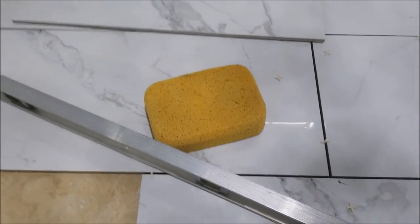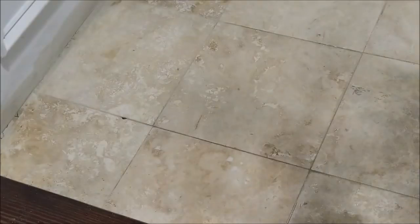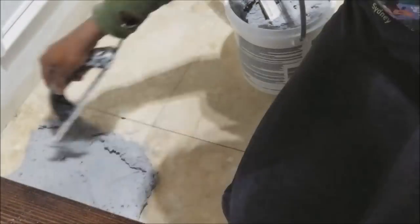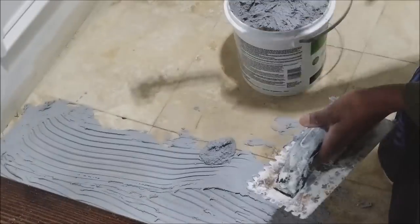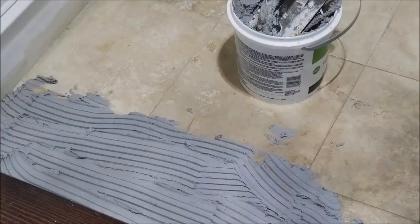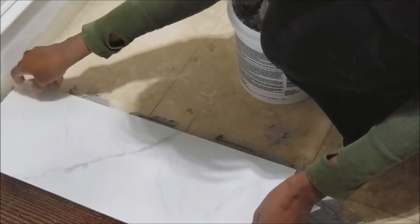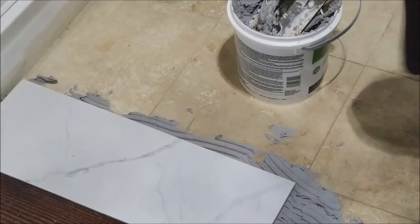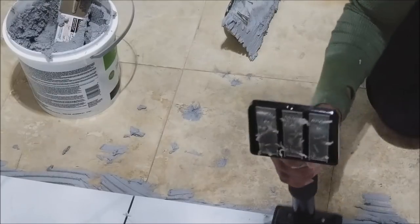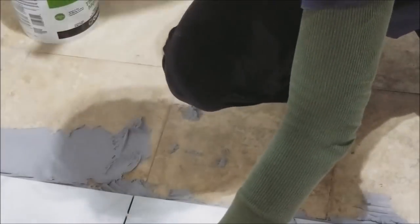Once you have done everything you have to do some cleaning up, so you will need this sponge. What I generally do is cut my tiles ahead of time and lay them out to see how they are going to look. Then I go straight to the cement, laying the cement down, and then I can just do all the laying of tiles without cutting in between. Using your trowel to smooth it over and then putting your tile on top. I didn't raise the tile too high because I didn't have a lot of clearance with regards to the door opening and shutting.